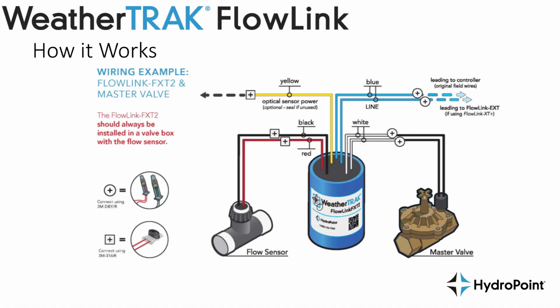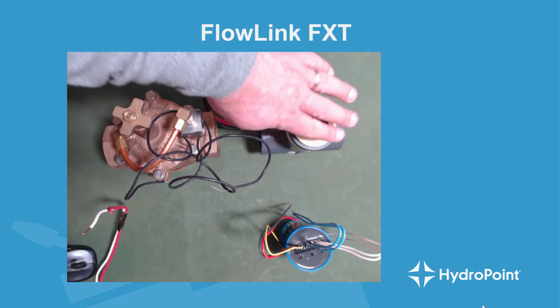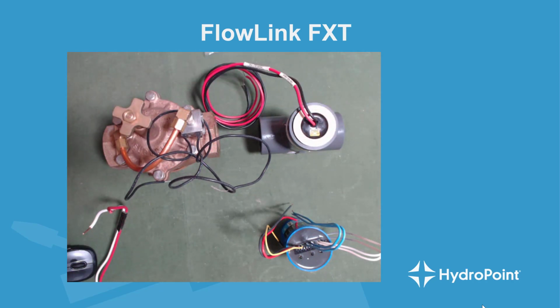Let's begin our wiring demonstrations with a quick example of how to wire an FXT. As you can see in this wiring diagram, you'll wire your master valve and flow sensor to the FXT, and this will handle all of the operation and communication for both of these devices. Clearly, the most difficult part in doing a flow project is installing the master valve and flow sensor. So when you go to install the FXT, hopefully you'll have the master valve and flow sensor already installed.